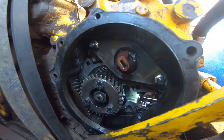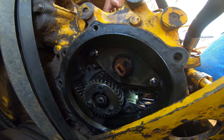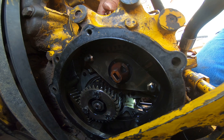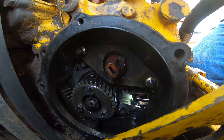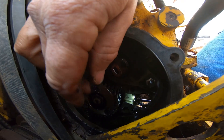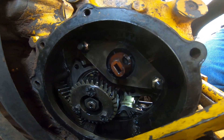In this case I'm not replacing the pump, but we've had trouble starting it, so I'm basically just trying to figure out if the timing is the problem — and I think it is. If you loosen these bolts you can actually put a 7/8 socket on the inner hub and turn it back and forth to adjust timing.